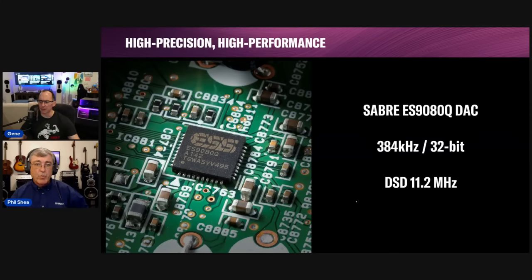Don't you guys do your own reclocking or something? I seem to remember, maybe that was on your AV receivers. We don't use our own chip anymore, but for a long time we used our own digital interface transceiver, DIT, a chip we built in our factory. It syncs the clock. You shove a digital signal into it, and it grabs that signal and controls all the clocks on the receiver or whatever device's circuit board, so it knocks down jitter. It's really hard because when you're shoving a digital bit stream into the product, the product has to catch that and then sync up with it. That's a whole art form right there. But now it's not the Yamaha chip, and I think that function is integrated into some of the other digital chips.